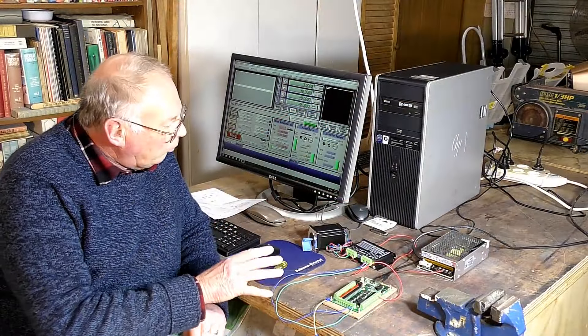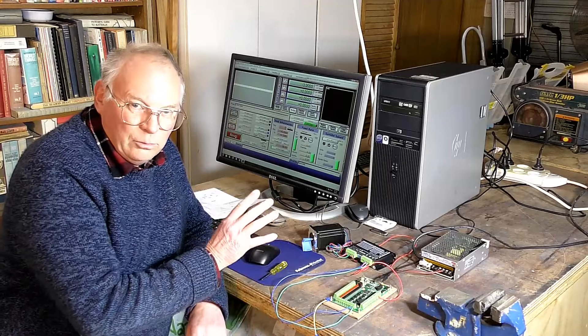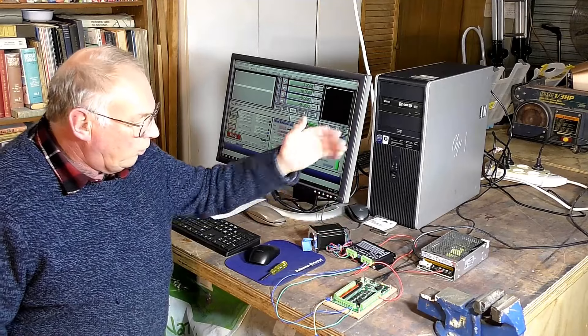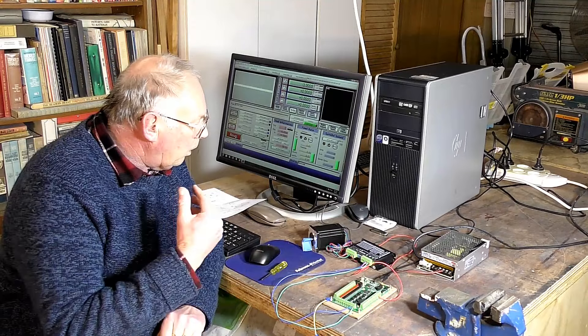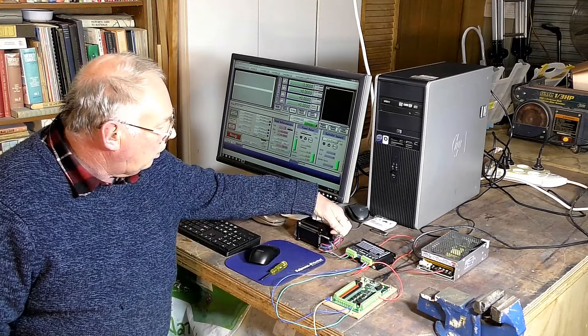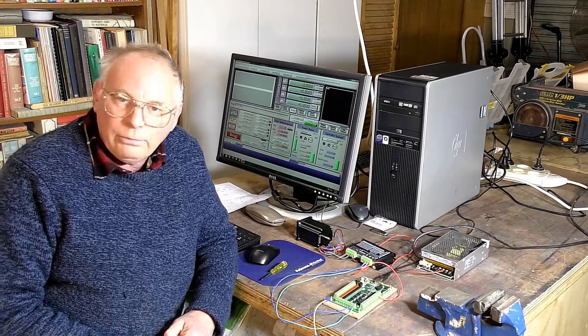I've broken this down and wired it up outside of the machine on the bench so you can see exactly what's going on, and that is how it will be wired up in the machine. There will be four times as many wires in the machine, which can be very confusing, so I thought it best to show it on the bench. In this video I also showed you how to set the DIP switches and how to identify the coils if you don't have paperwork. I hope it's helped, and in the next video we should see some movement.